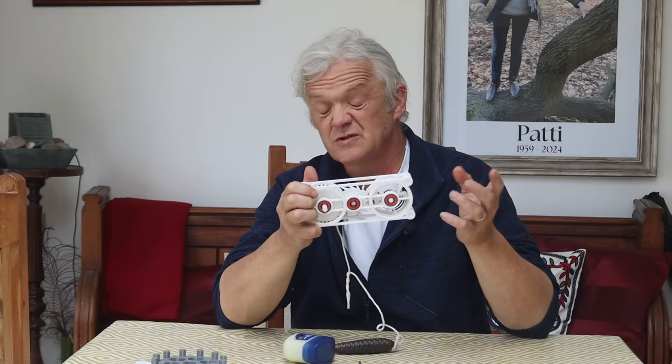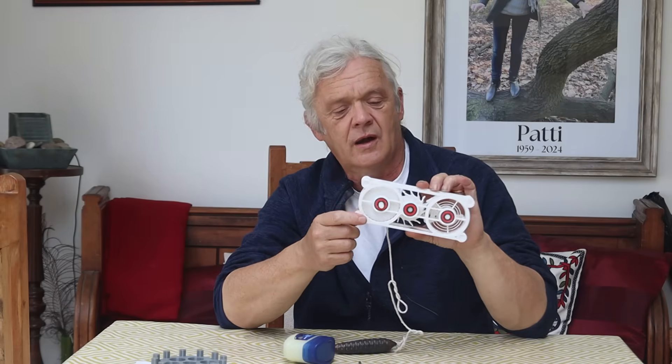The first thing — a friend of mine called Bordlund Johansson, who runs BLG Engineering, told me to use Vaseline. He said put a bit of Vaseline on it and that'll help things going, and sure enough there's Vaseline on the end of this wheel which could well have contributed to it working out of the box, which for escapements is pretty unusual. The second thing recommended was to use bearings not with rubber seals but metal seals, and preferably ceramic bearings to cut down on friction — then you can reasonably guarantee an escapement working straight from the print. This was printed on the Elegoo Centauri Carbon, which is a fairly accurate machine, and I'm pretty pleased it worked straight away. This is going to be the heart of a spring motor mechanism.